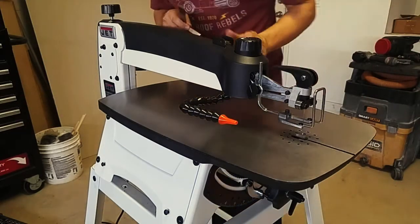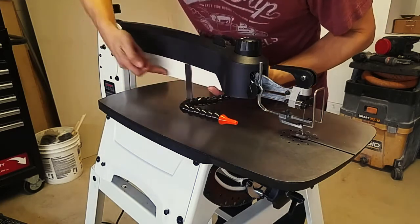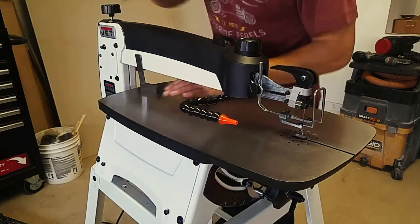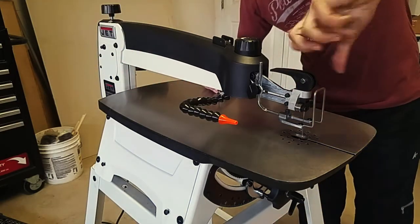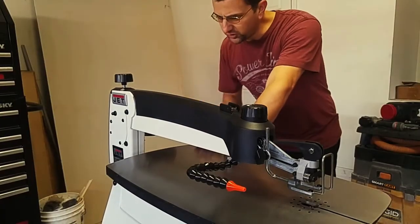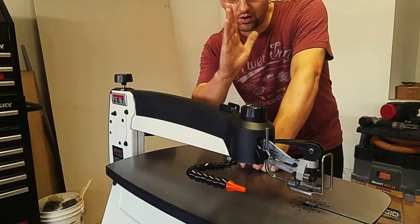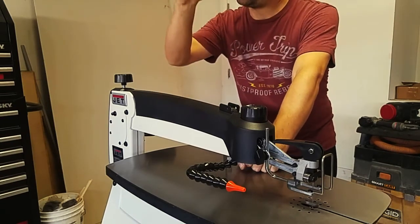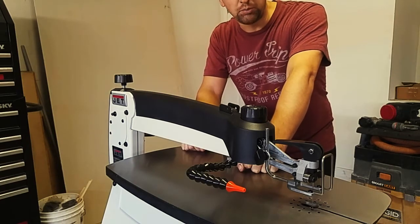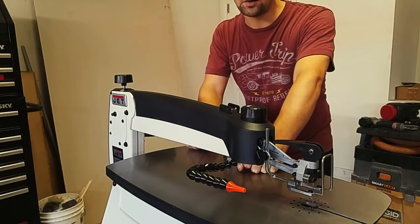There are a couple of adjustments they tell you to do out of the box — they don't have to do with the stroke of the blade. A machinist's square really helped me. The first thing I had to do was parallel the bed — I put something up here, put a mark, moved it over, and this knob will make sure the arm is actually parallel. The other thing you can control is blade tension, which I showed you when I tightened the handle. The other adjustment is with the motor — if you loosen the bolts, you can turn it slightly forwards and backwards, which changes the blade stroke, tilting it forward or back. I prefer the blade going straight up and down as best as possible, and I dialed it in to almost all straight up and down — not quite, but still pretty good.